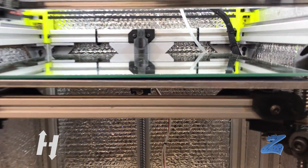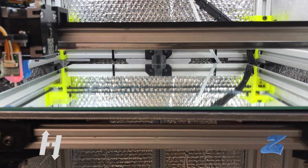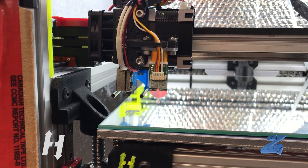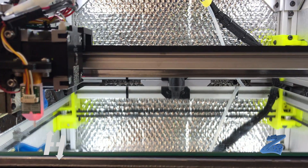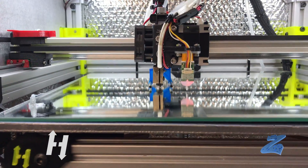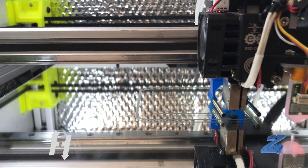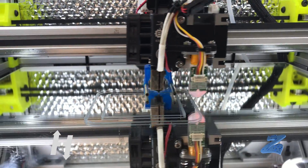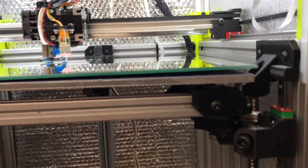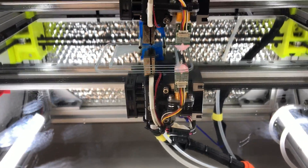So the bed is currently compensated. The distance it was off — we're purging the nozzle, and we are still purging, now crimping. And we do have a quite nice first layer, even though this gap is creating an issue for us, the printer still manages it quite well.